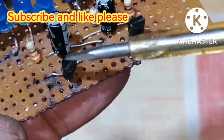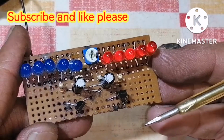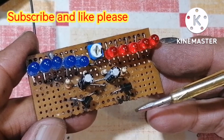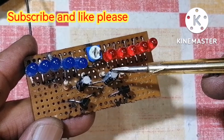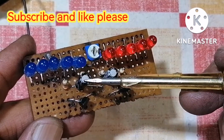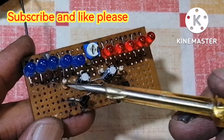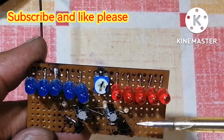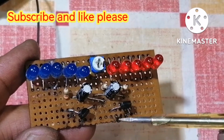And same thing this one. Base of this one will go to 3.3k, and negative of this capacitor, and this base goes to 3.3k, negative of this capacitor. This collector will go to 330 ohm, this one. This collector goes to 330, and emitter will be negative,